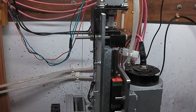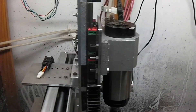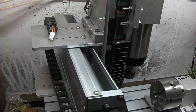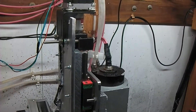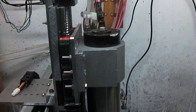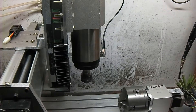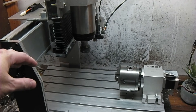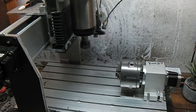That gives enough travel to move around the whole base. Overall I'd highly recommend this sort of upgrade — it does take a fair bit of time, and the whole Z-axis assembly took quite a while. Cutting the sides wasn't really that bad, but if you have the same machine you need to work out whether moving the entire gantry up by 100mm means your cutter is still going to be useful.